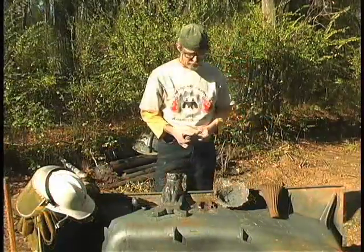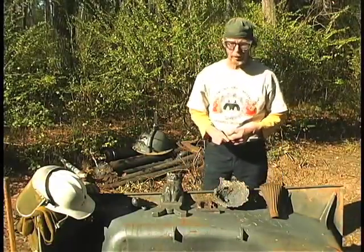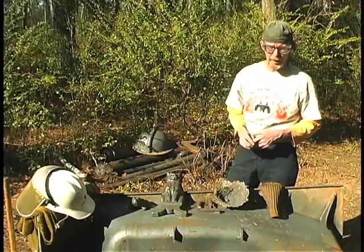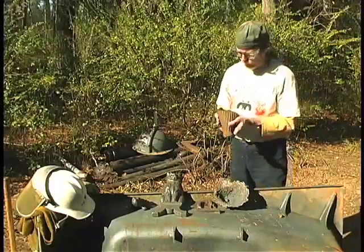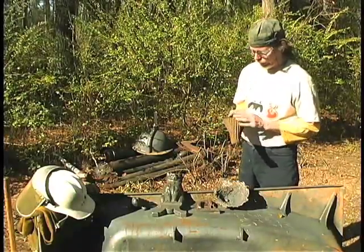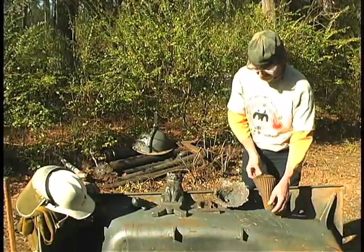quality castings. One of the essential things that I've learned from this is that to get quality cast iron products and castings, it's good to have real good cast iron scrap going into them. This is an old stovepipe leg that was made many years ago. It's thin, it had real good detail. It's still a beautiful object even though it's rusted.